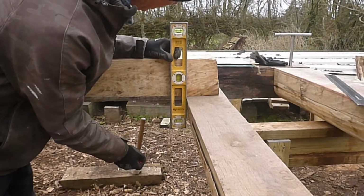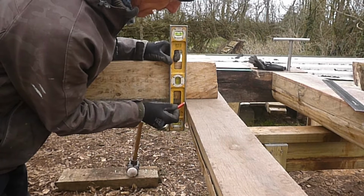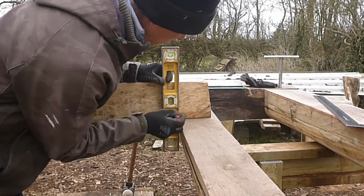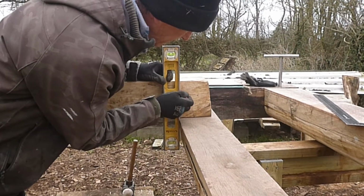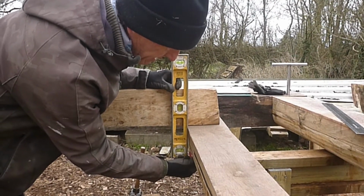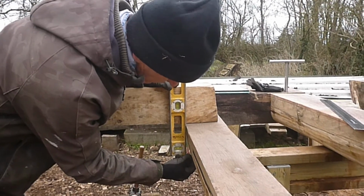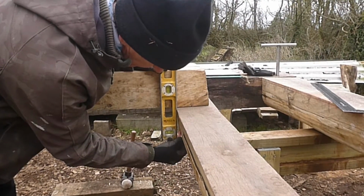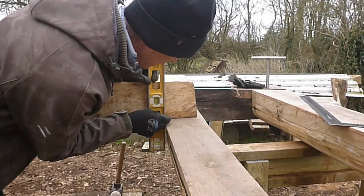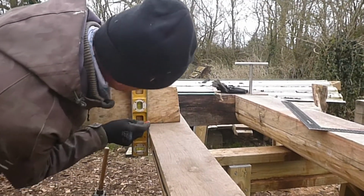We're using the spirit level to give us a straight edge, and that tells us that the spirit level is in contact with the stud at the top, so we can mark that same point on the sill where the sill is going to be sitting, like that, and we can estimate what the distance there is, which is probably about looking on for 5/8 or nearly 3/4 of an inch. So we have to estimate that out this way. Like that, and maybe even a little bit more.